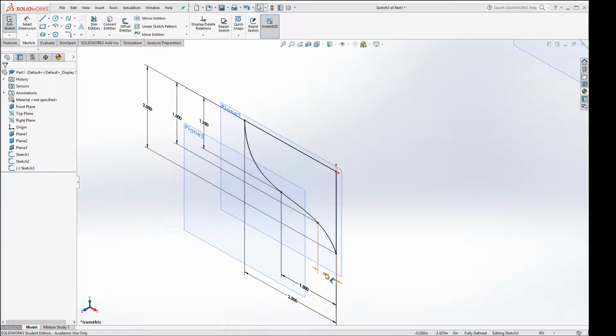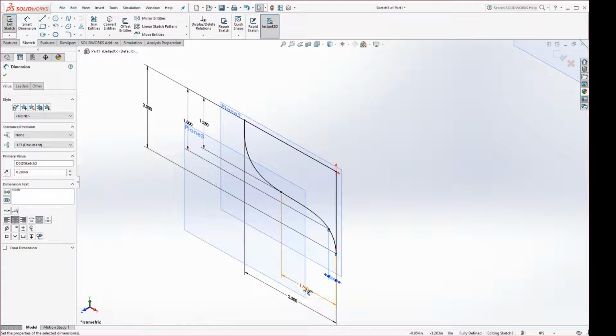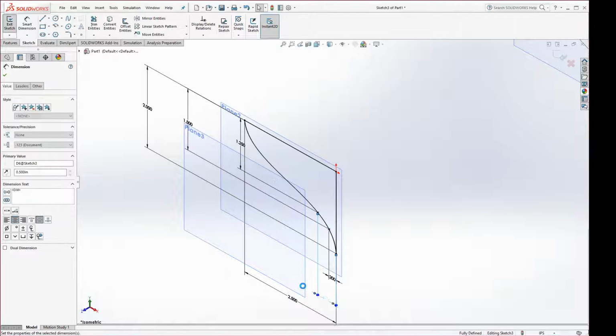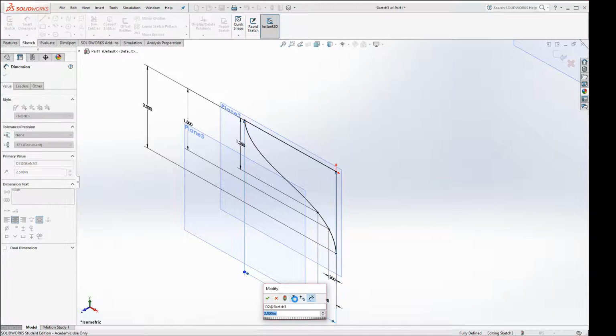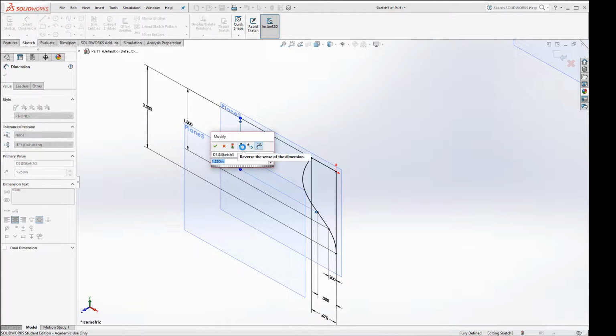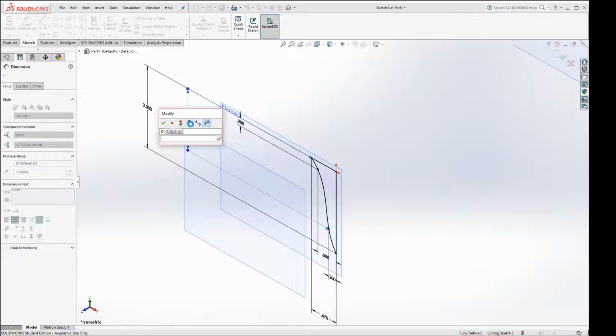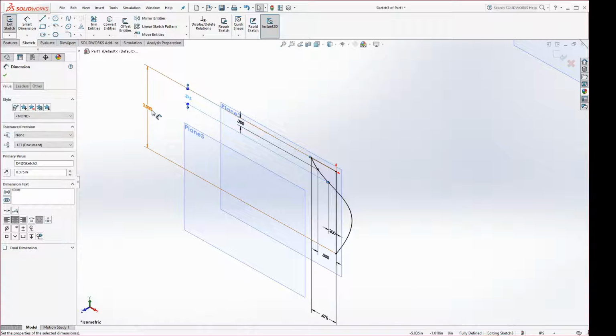Okay, so for example, start maybe with this one, 0.2, double click on the 1.5, that's 0.5, and the 2.5, double click, 0.675, and now these ones, the smaller dimensions first, double click, 0.2, the 1.5 is going to be 0.375, and it looks a little, see here, this is what I was talking about, where it looks like it ties into a knot. Geometry crosses over essentially itself, and that's no good for extrusions.